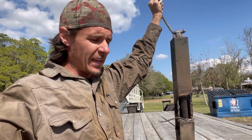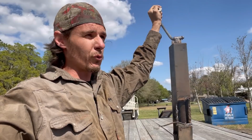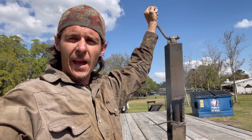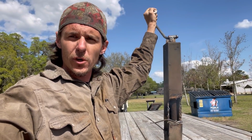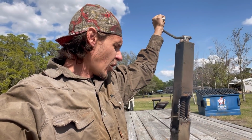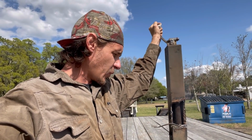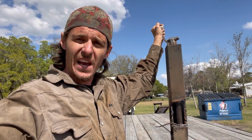So let's say you forget your oxygen suddenly, you forget to refill it, run out of cutoff discs. You just really have no alternatives. You don't have any air arc capabilities, whatever your problem may be. This is an alternative. It's not a great one. It took me 8 rods to cut these 4 little welds, where if I was using a torch, it would have taken me like 2 seconds.